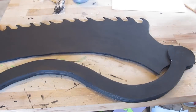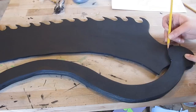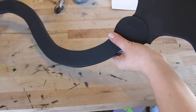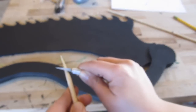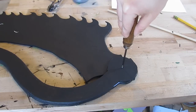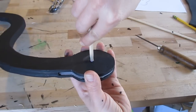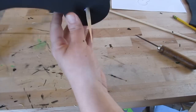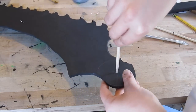Draw a line on it — before you put any holes in it, you want to check it to make sure you've got it right and it swings smoothly. Try swinging it to the open position and swing it back to the closed position. If you've got your line so everything is smooth, that's the spot you're going to keep it in. Use a quarter inch dowel, carve a piece to a point. Use some kind of a tool — an awl — and puncture that awl right through the middle. Then use your dowel to open it up, because the quarter inch dowel is what we're going to use to pin it. You can take it apart — it makes it a little bit easier to work with. Make sure you puncture the center piece too.